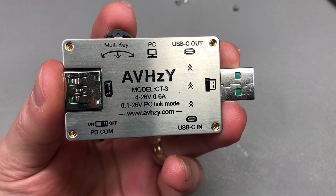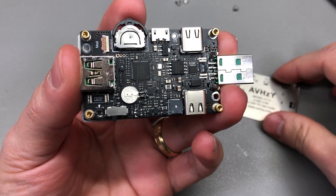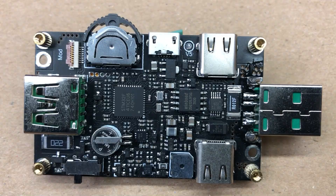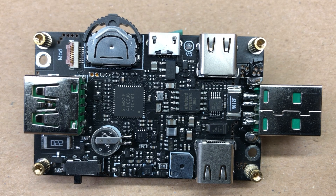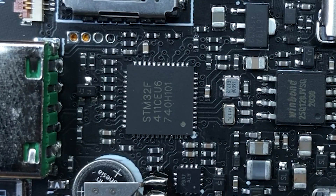This wouldn't be a true review video without a teardown. Four screws on the back and four screws on the front, and we get a chance to look at the electronics inside. The main microcontroller is an STM32F411 — an ARM Cortex-M4 series microcontroller that can run up to 100MHz. This is no doubt responsible for the processing power behind that smooth high refresh rate display and maintaining the PC USB connection. I'm not sure this is a genuine ST Micro part though; due to the chip shortage they could be forced to use a clone, as I don't see any ST Micro logo on it.